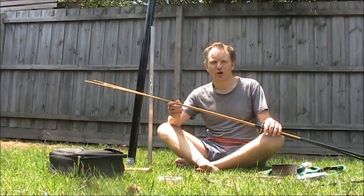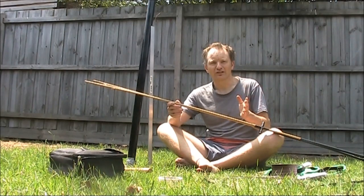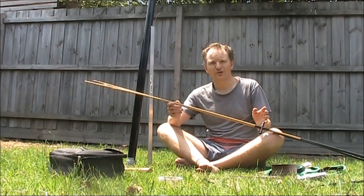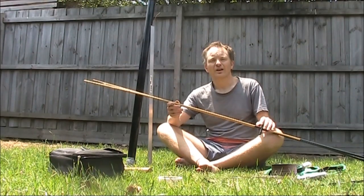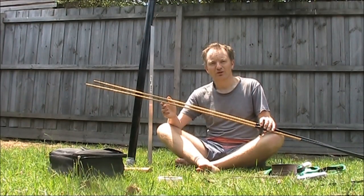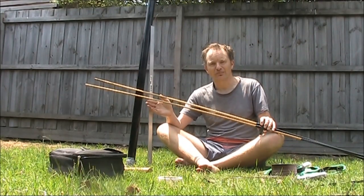I've had good results with the oblong antenna on 2 metres — a full wavelength loop twice as high as it is wide. That gives an impedance of 50 ohms, handy for direct connection to 50 ohm coax cable. Viewers have tried the antenna and have had equally good results. So here I am at home to try the bigger version for 10 and 6 metres.